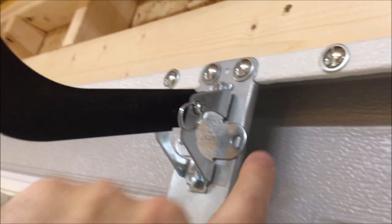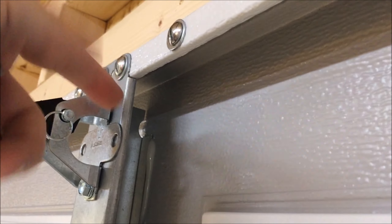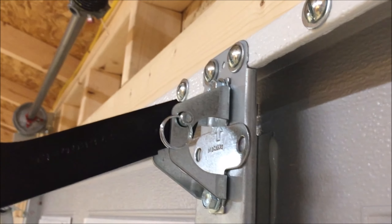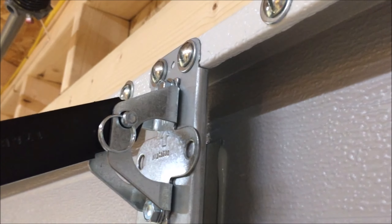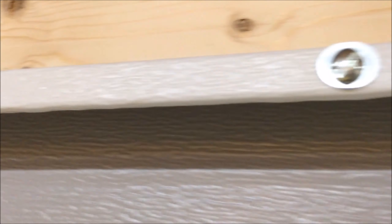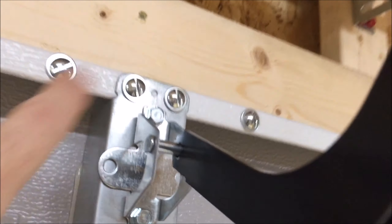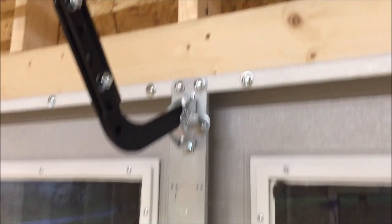The other piece — it tends to want to rip this thing apart and that thing's just glued on there. There were some little tabs right here, kind of holes in there, and there were no screws in there at all holding it together — it's just glue and a tab. So you put this thing on there and start reefing on it, it'll probably rip apart. So I took a couple of nuts and bolts and bolted the angle iron there — and that kind of ties this all together.